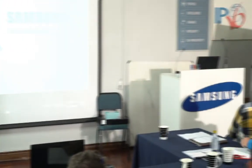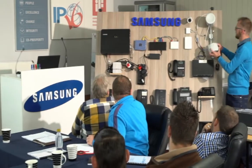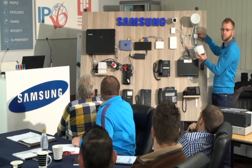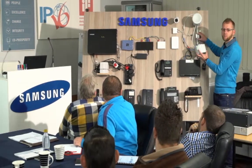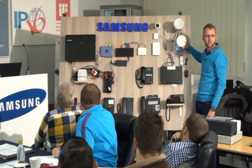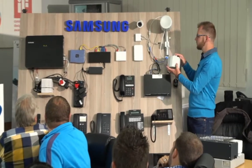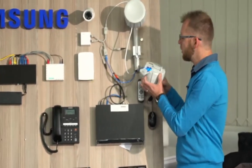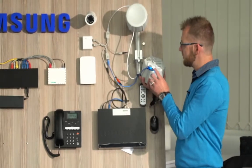The rest, we plug it into a switch, log on to it now, and run through the setup on it. I just want to explain one thing. When you do mount the bracket, there's a clip over here. This clip has to be on the top. The reason why it's not on top here, so if you do notice it's wrong, is just easy access for us here. But once you put it the right way, it will clip on in its place here.